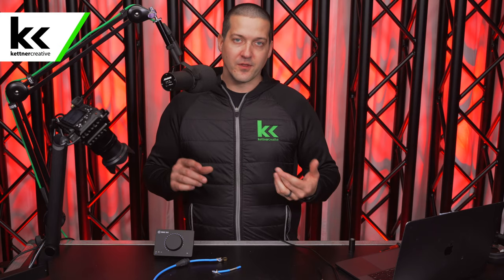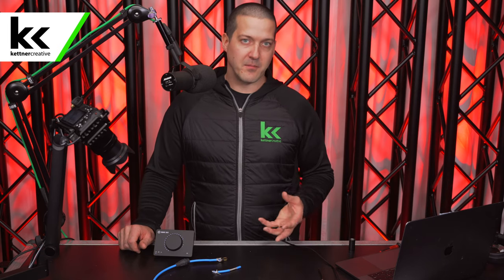So what do we recommend for a studio? If you're in a studio with a lot of guitar amps, big magnets, speakers, TVs, computers, and all that type of stuff, you would be safer having star quad cables to help protect you from all that interference. It might not be an issue in your particular configuration all the time, but it is a safer bet. They're not that much more expensive, and in that environment they are more likely to help you than hurt you.